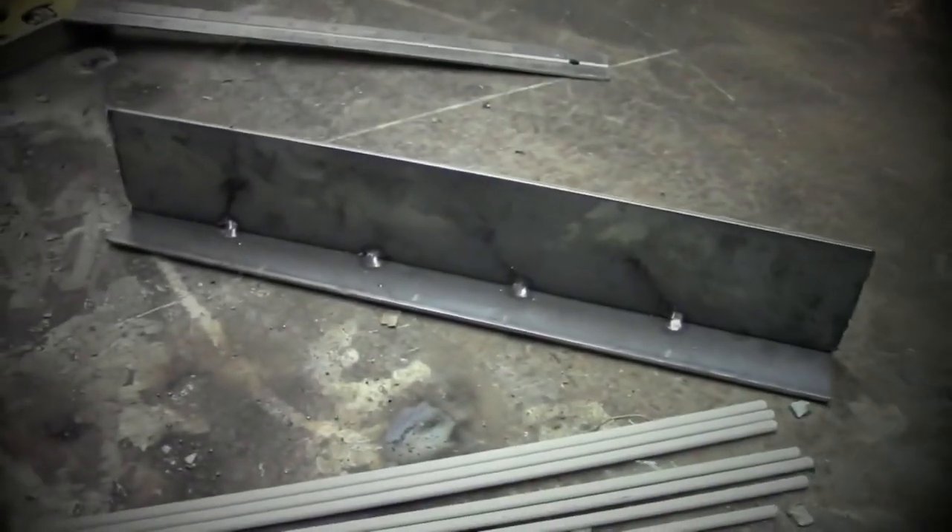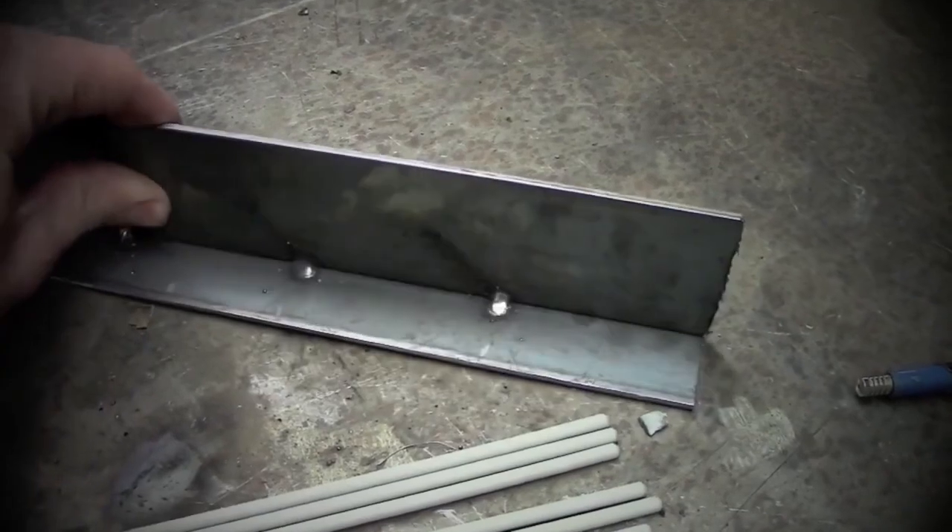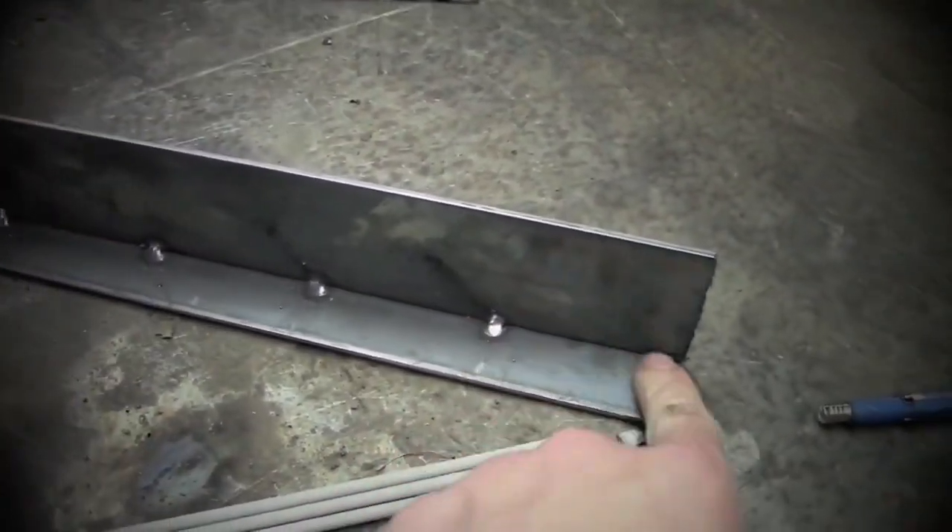What you're doing is controlling how much heat spreads out from immediately around the weld. Now, I don't officially recommend using tack welds to mark out your back-step, because with thinner material and smaller tack welds you'll probably just get cold starts — I used them because they're easy to see on camera. If you're doing something with a lot of smoke like stick welding or flux core, you might want to use a soapstone or silver pencil for cleaner applications. For smoky processes, I take an unburnt stick electrode stub and place it as a marker, because you'll see it as you approach it.